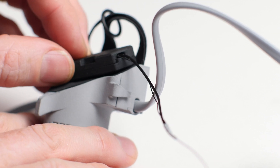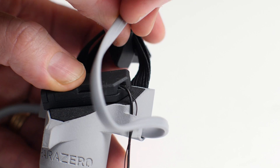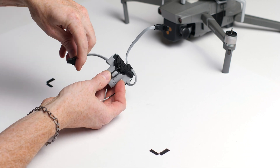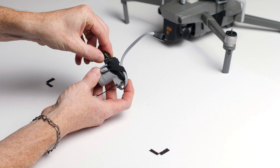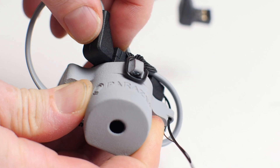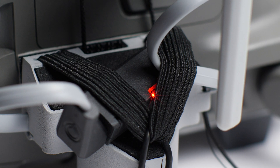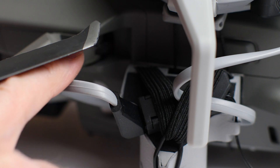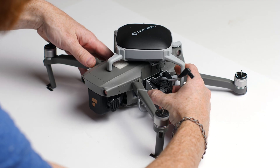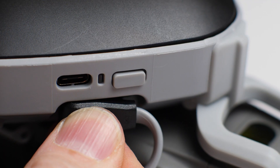Place the receiver on the ASTM module and tuck the antenna into the side hook. Pull the right side cable through the elastic strap, then attach the strap. Attach the left side cable to the receiver. One thing to note: you're supposed to install the receiver so that the cable points downward, but I tried it both ways. I actually preferred having the receiver upside down so that you can more easily see the indicator light on the side of the receiver. I tested it, and I think there's sufficient clearance between the cable and the propellers. Once that's ready, attach the module to the side of your drone, and then lastly connect the loose cable to the SafeAir system.